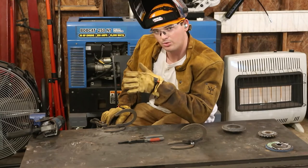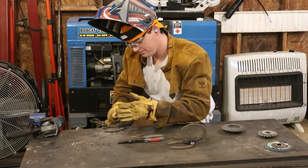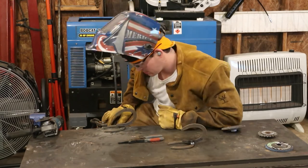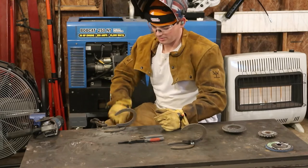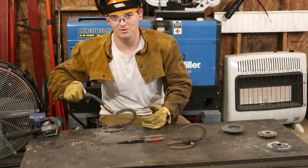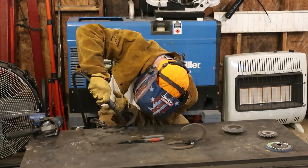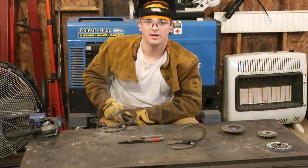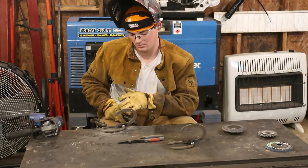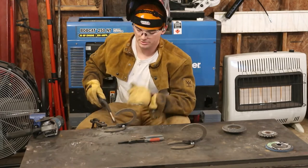I do notice that it's pulled a little bit to the left or back toward the camera, so I'm going to back it over — a couple more easy hits, just like that. It's just how I want it. The weld on the other side, because it's tack welded, I can't really move it right now, so you get to see me weld from the opposite side. That turned out really good — nice little slick weld right there. I'm going to come back on this side and weld over this tack, and I'll get you a close-up in just a minute of what it looks like.